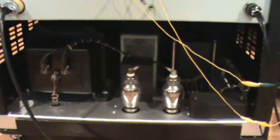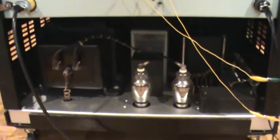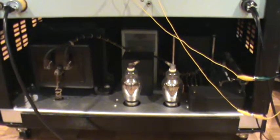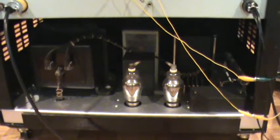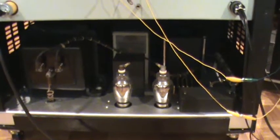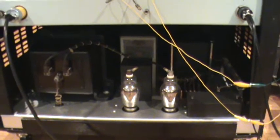I'm going to go around the back. There's the power supply down on the bottom with a pair of 866 mercury vapor rectifiers. This is a choke input power supply. In the CW position, it's 2500 volts under load, and in the phone position without the modification that I've put in, the voltage drops to 2000 volts under load.